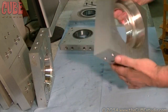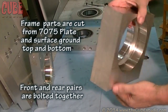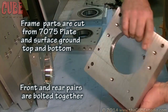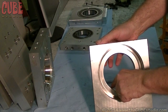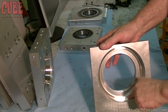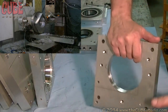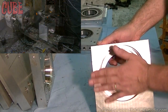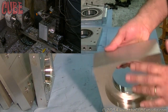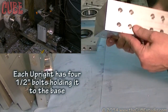This is one of the frames for an Ultra during the machining process. They're bolted together, and while they're together all of this boring is done for bearings so it's absolutely concentric. This is surface ground in the back and bolted to a space plate, surface ground on the edges, or machined on the edges — that's just faced off, and that's ground on the bottom.